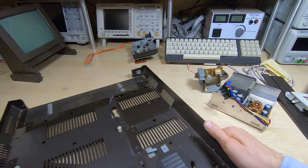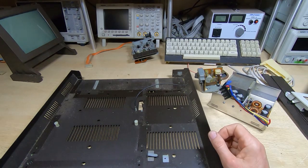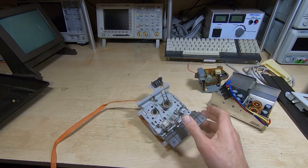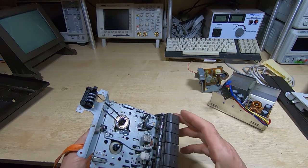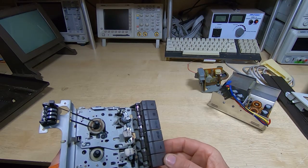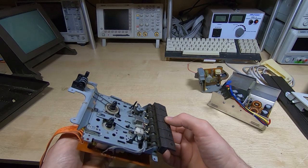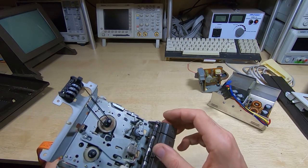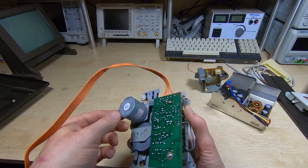The chassis is in good condition, just needs a clean — no bends, it's not distorted, so that is recoverable with no problems. The cassette drive seems fine; it needs a new belt, needs a head cleaning, it's had a fair amount of use so it needs lubricating, the keys are all sticking, the drive doesn't always engage properly so it needs contact cleaning — desperately in need of a clean — but other than that mechanically it seems fairly sound, so that's quite good.